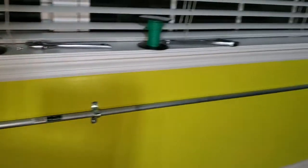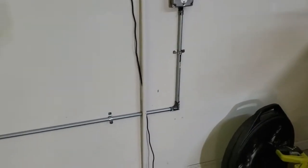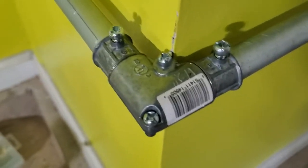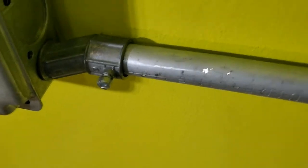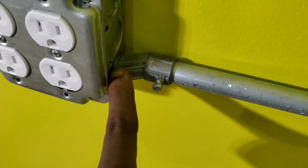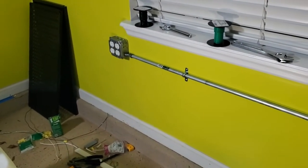This has been a pretty cool project. Here we are with everything put together - I've turned the breaker on and I think it turned out really nice. One thing I wanted to point out is these 90-degree EMT connectors. Make sure whenever you do these, the screws are really tight - as tight as you can get them everywhere. The reason is that EMT conduit can be used as a grounding source, so you want to make sure everything is nice and tight. When you screw them into the box, make sure everything is real tight so it's one continuous piece for the ground to flow through.